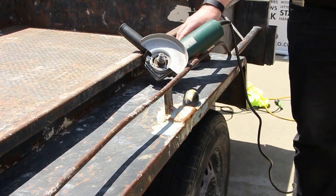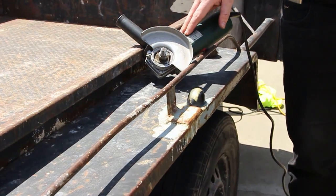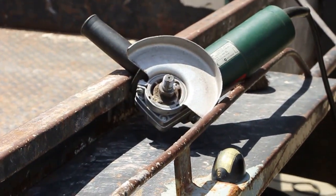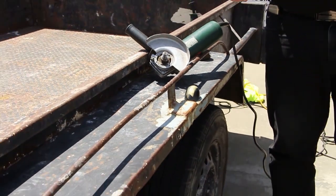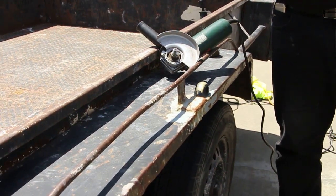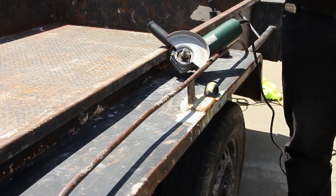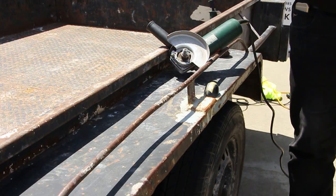This is a 14 by 2 thread that I've got on this 5-inch grinder. Australian grinders are generally running 14 by 2 and 10 by 1.5. If your grinder is an American grinder or if it's running on an air tool, there is a chance that it might be 5/8, 3/8, or some other sizes. Give Josco a call — we can help you with those other sizes if you have one of those. They're less common but we do have them available.